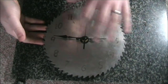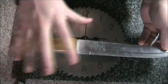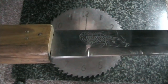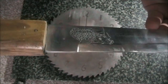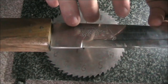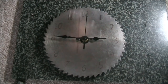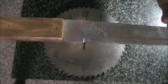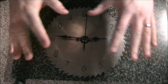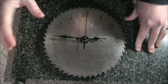Just wanted to finish off by showing this: the clock we've done using a PP3 battery looks pretty good, but I also mentioned a knife project. This is one my brother brought back from Tunisia — it was cheap tin and plastic handle and scabbard, which I've removed. The etching was done with a Scalextric transformer which kicks out more juice and is a lot deeper, giving it a nice 3D embossed effect. If that's what you're after, use a Scalextric transformer or battery charger. If you just want a light etching, carry on with the PP3 battery. You could probably achieve deeper effects with the PP3 if you just did it for a lot longer — experiment on a bit of scrap steel and find which method you like more. Leave your comments below and I'll see you all soon.